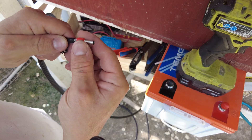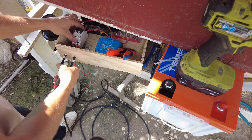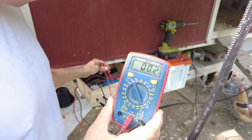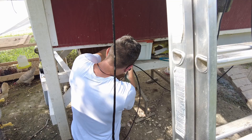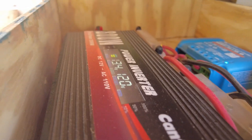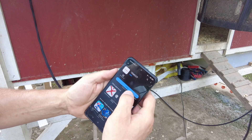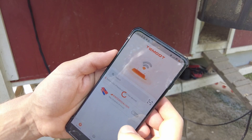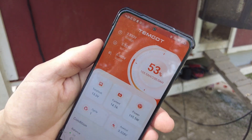Getting the solar panels connected here — I'm using ferrules to make sure the connections on the ends are secure when they go into the solar disconnect, and covering the wires in wire wrapping to protect from the sun. With the panels connected in series, they're both about 33 to 34 volts each, so we've got about 66 volts — which is what we need to see. Got the battery hooked up, everything switched on, and we've got 13.4 volts on the inverter. The solar charge controller is doing its thing.